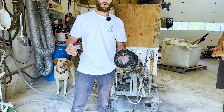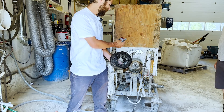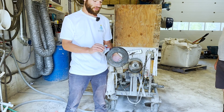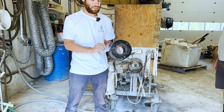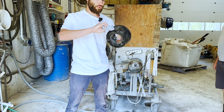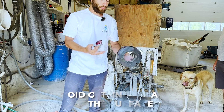This plug prevents water from going back into the system where the dry concrete and cement powder is. If the water gets in there, it's a big mess — if it hardens, you have to go in with a chisel to clean it out. So we're going to put some grease on the side of this to help lubricate the edge and seal it up a little bit. Even with all of this, we're still going to avoid having any water pressure directly on the perimeter of the cap. Avoid getting any grease on the surface — this seal will do just fine.